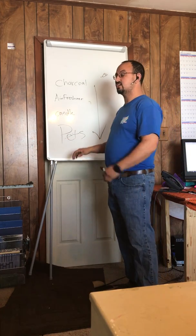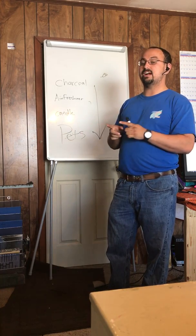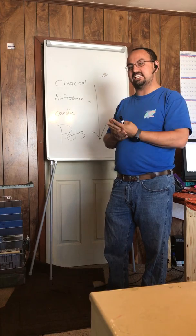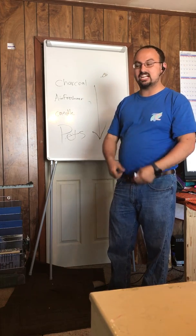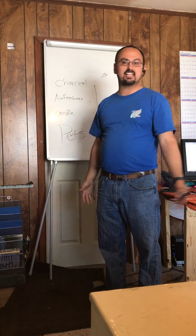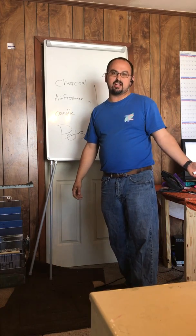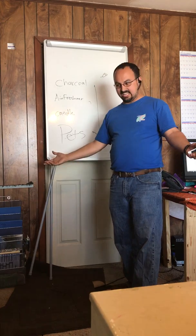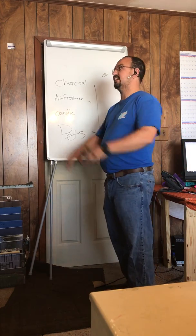Keep in mind, if you let it go too long, that hair, just like the air, will find a way around that filter, because the unit wants air, and it will get it if you give it an opportunity to. It'll suck that filter out of there if it gets a chance, and then it'll suck it up in there and everything else around it, and you didn't even know. You just noticed like 3 days ago it wasn't working that great. All of a sudden, it doesn't sound as bad as it did, and it's cooling fine. And you know, you're going to sit down and have dinner with your cat, right? You're going to brush your cat. That hair's just going everywhere.